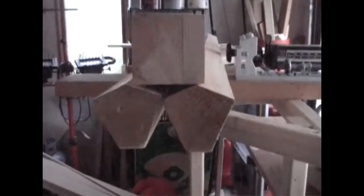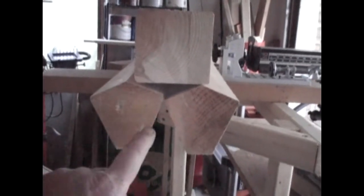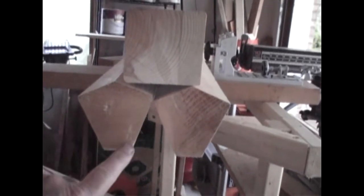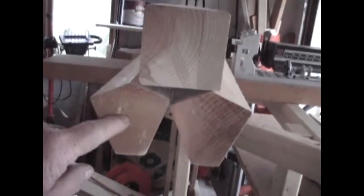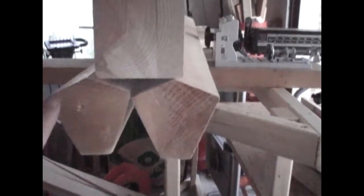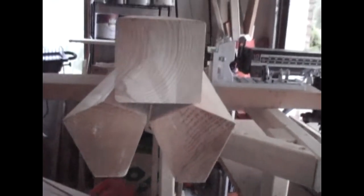Here's what we're using for the corners. And I started out with 2x4. This angle here is 67.5 degrees, which is the complement of 22.5. So that was my first cut, and then second cut was the other side. And of course at the time this surface was flat. And then I laid it on this edge and cut this at right angles. So hopefully, that's what we're going to put at the corners. And where it meets the house, the jury's still out on that.